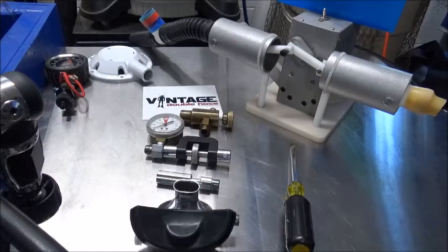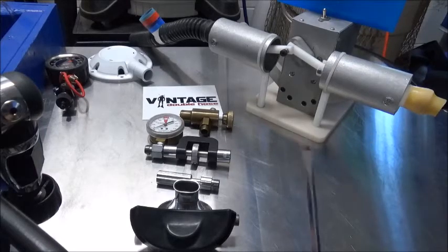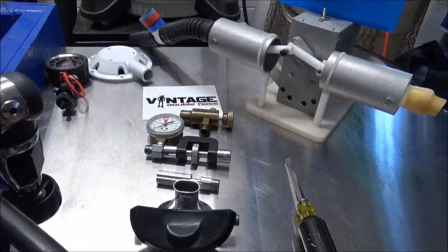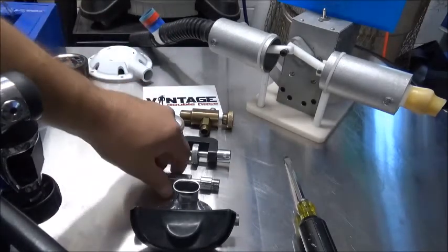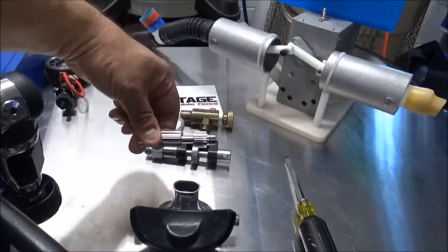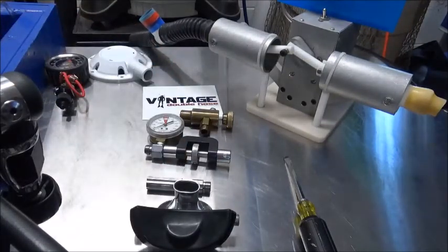Okay, let's see if we can get the lever height set on this hoopty and bring it on into the finish line. A couple of ways to do this, your choice. When you're adjusting your lever height, you can use the screwdriver you put the volcano orifice in with. You can use any type of inline adjusting tool. This is the one I sell on the website store. It's relatively inexpensive. If you're working on a lot of regulators, it makes things go a lot faster.